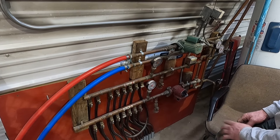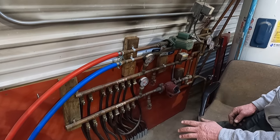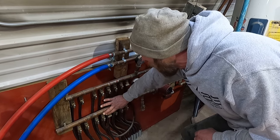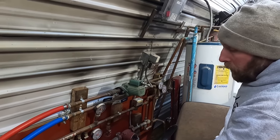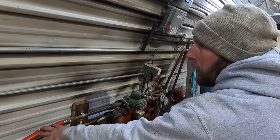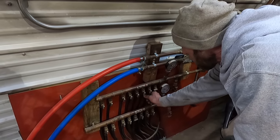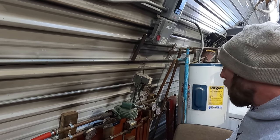And the neatest thing is the floor is always room temperature. The floor is always dry. Some of the newer systems now will isolate the boiler water from the shop floor water. They will have another heat exchanger in here, so it could be antifreeze, for instance, or something that wouldn't freeze. Maybe this one wouldn't, because there's like 300, maybe 400 gallons of water involved in this setup that goes up to my boiler. But in the floor, these are pretty small tubes. It might only be 40 gallons, maybe less, for the whole floor, I don't know. But anyway, it's way less.